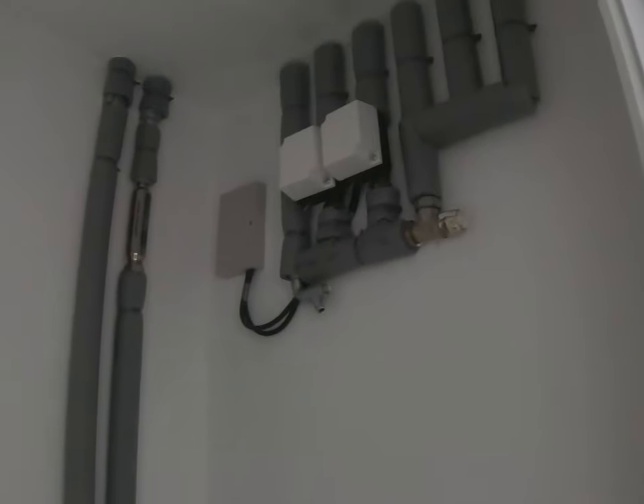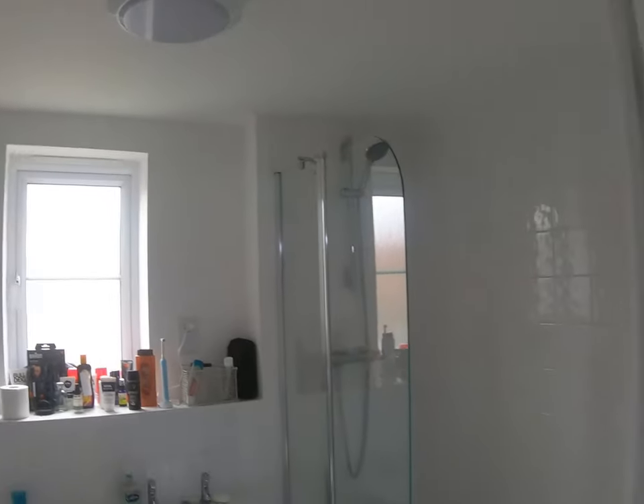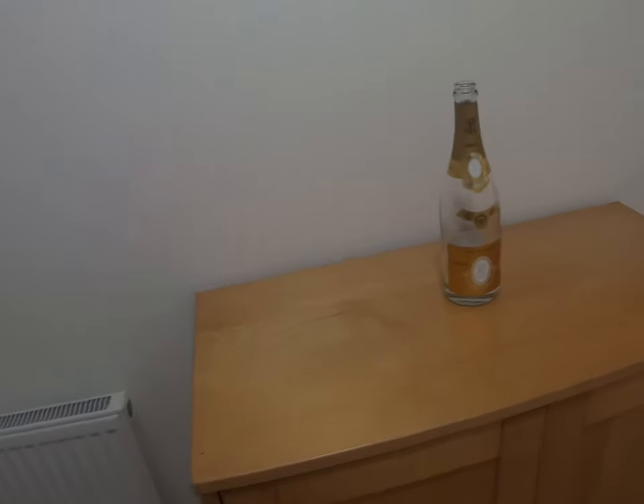This is the bathroom — I'll scope all the walls, go around cupboards. There's no electricity in there apart from heating controls. We might have a deviation here: we've got an extract fan in this bathroom that isn't fused down to 3 amps spare. However this make of fan might not need it — I haven't read the manufacturer's instructions, so we'll come back to that later to see if it requires 3 amp fuse protection. The bathroom light is IP-rated and suitable for the zone it's in, so far so good.